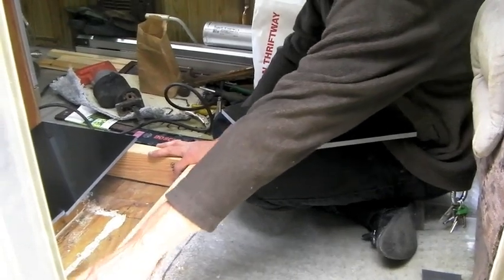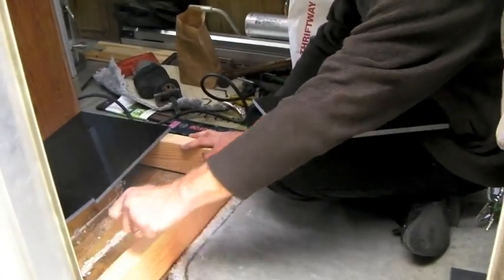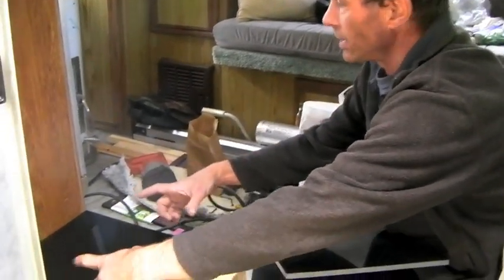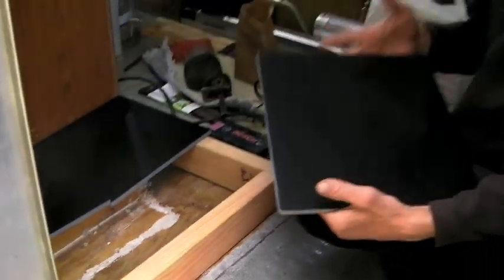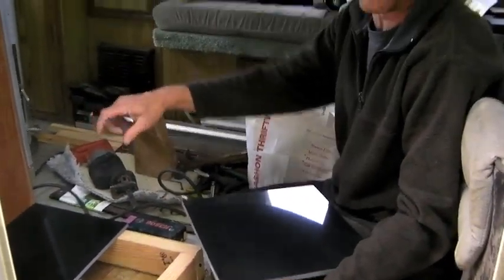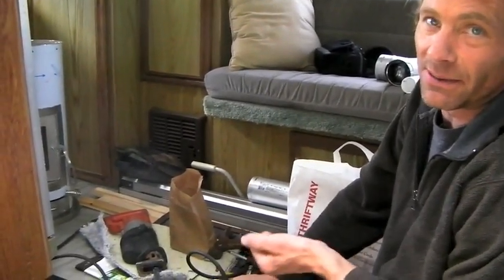I would personally be happy if we go ahead and attach this frame down on the floor really good and tight, go over it with three-quarter inch, then go over that with your Hardy Backer — your flameproof material. At that point we'll put three holes in the base and bolt it down, then cut the tiles and put them around the base. That'll save us about three hours of maddening work.